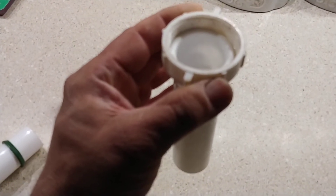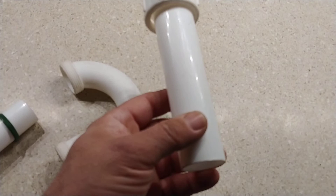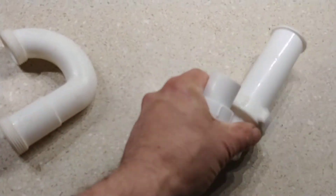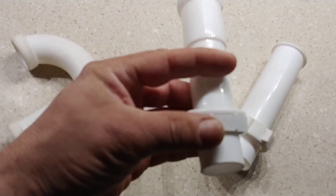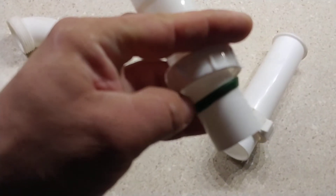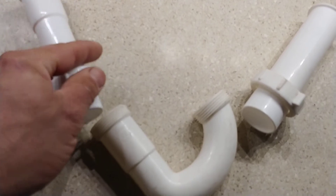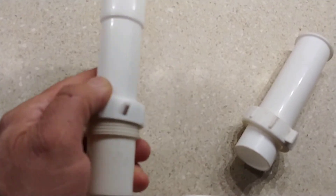That T — and this piece is open like this. Now you would slide the nut up on here, and then it has a bevel gasket. You see how the bevel goes down? That will go right into this trap, and you just tighten that — it's hard to do with one hand. Then you tighten it up like that.